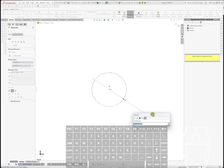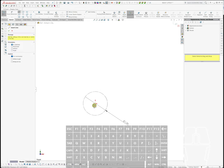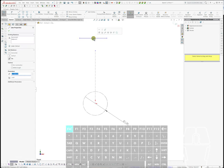I'll say 1.9 inches, a 16th under, just to be on the safe side. Obviously, I don't want it too far under because then it's more and more cantilevering. I'd rather be in shear than in cantilever, but it'll work. All right, so basically, let's have some more reference geometry. Here's this guy, and let's do this to represent the handle.